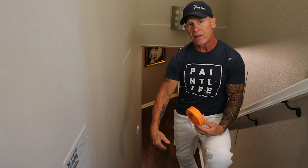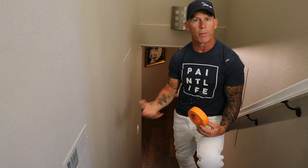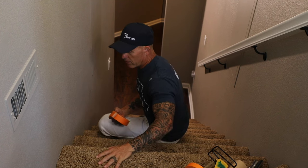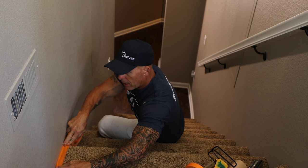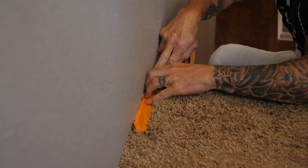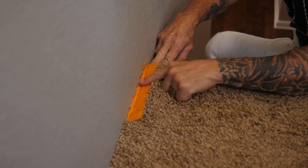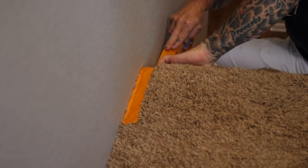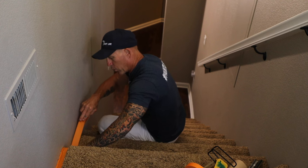That way you can get paint behind the carpet, pull the tape, and the carpet will fluff back up — it'll look like the walls were painted before the carpet was installed. Here's the finger tucking technique I use when I'm masking on stairs. I get my tape up against the wall and then I push down, tucking and pushing the carpet down. You can see how somebody's already painted this carpet and it's stuck it to the wall a little bit.